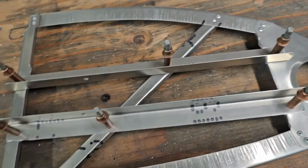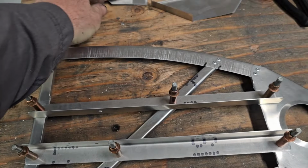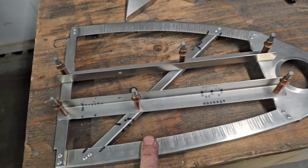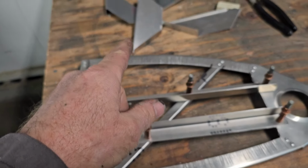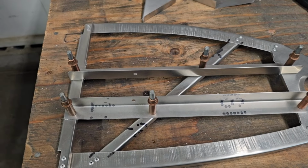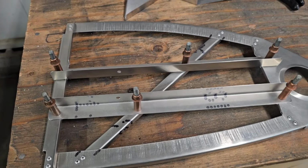Right now it showed 1 rivet in each spot, so I'm going to go ahead and rivet this piece on. Probably go ahead and get the rib back on the plane, get it squared up, get the brace pieces riveted on to the nose piece, and then I'll probably just leave them Clecoed to the spar web.